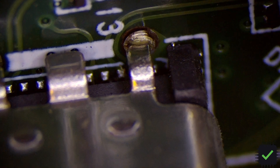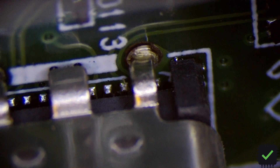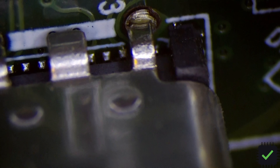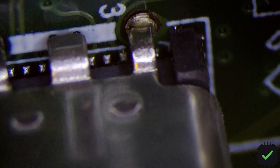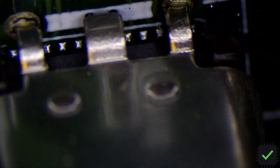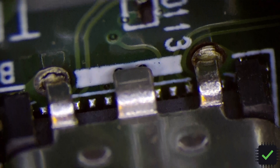But I'm not going to be able to get in there with my soldering iron and solder them properly. So what I decided to do is actually just remove this whole thing completely, clean the pads and the post mount holes, and just use solder to resolder the whole thing. That should be the proper repair. I can definitely see four pins are broken, and there's one pin under this post — I don't think I'll be able to resolder it without cleaning the solder first.